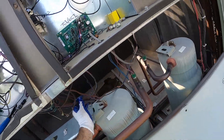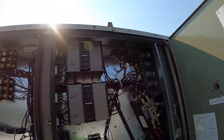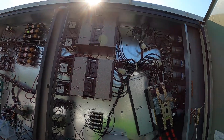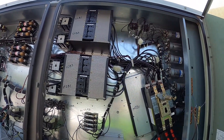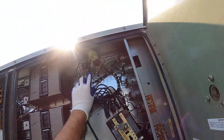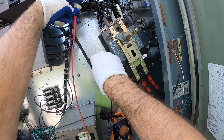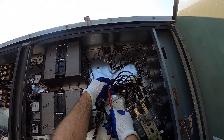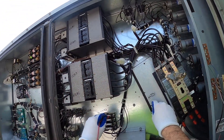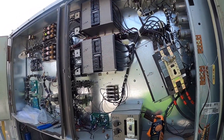Then what I did next was figure out what wires came from that motor — I just traced them back. Trane units are actually pretty nice with the plug connections for their motors. So I unplugged it and ohmed it out with my meter. I checked the ground on the other side of those fuses, and before I unplugged it I definitely had one motor that was shorted to ground. I can hear my meter ringing out — I'm just reading the ground, I got continuity. So that's definitely the bad one. And after unplugging it and checking back to the fuses, I'm no longer grounded.